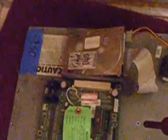The only thing I could see so far, I haven't looked really close, but on this board where the JAMMA connector connects, there is a slight burn mark there on 2 of the contacts, and they're still intact. They don't look that bad. They just look like a very slight burn mark. I think it might even clean off, and the rest of it looks fine. And on the back side, looks pretty good. There's a slight dark mark there. I don't know if that's dirt or just a burn mark. I'll find out and wipe it in a little bit, maybe clean it off a little bit. But maybe it was serviced for something minor.